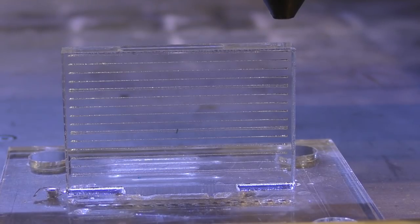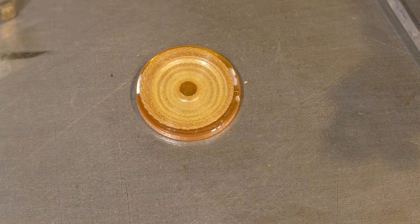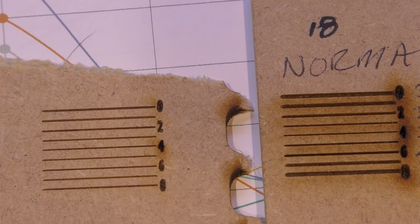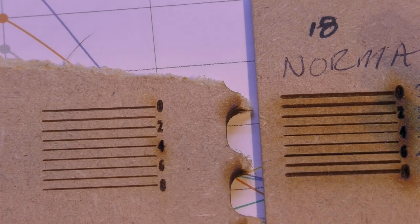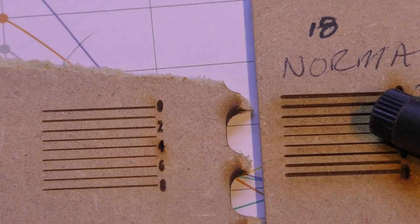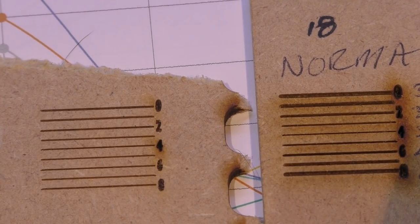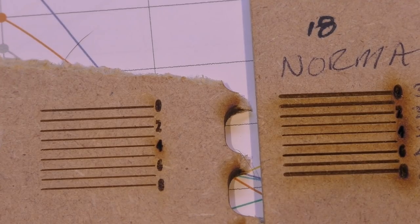Obviously nothing has changed the focus because it's still technically on the surface. And here's what our final lens looked like — just a three-millimeter diameter spot in the middle of the lens remaining. We all know the model of a focal point: how the rays come from the lens down to a narrow focal point and then open out again underneath. So we get a converging beam and a diverging beam, and at the focal point we get the crossover where we get virtually the thinnest line we can get. The thinnest line in this set must be regarded as the focal point, and sure enough we can see the focal point was supposed to be 38mm and is 38mm. The point is proven — this is a normal lens working as designed.